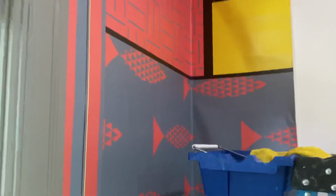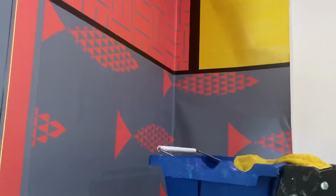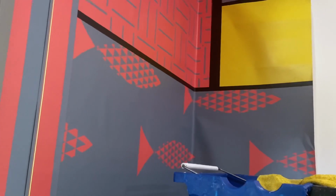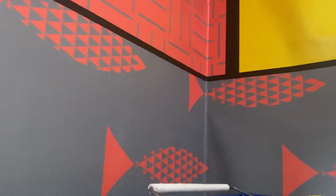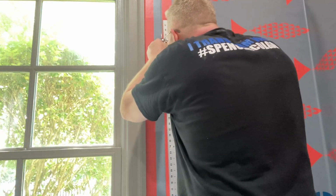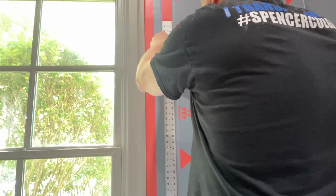Residential wallpaper, you can get away with a 1/16 of an inch. But here, you see that roundedness? That's the wall covering saying, I don't want to go into this corner. So you can anticipate that even if you gave it 1/8 of an inch into the corner, unless you heated it up and you were confident of your material, you can expect that even if you cut 1/8 of an inch, it's going to constrict this way and perhaps leave your corner with a hairline. You don't want that. It's like a target, it's like a round target with those balls.